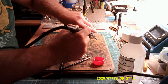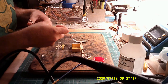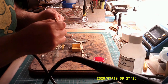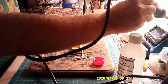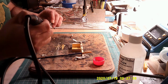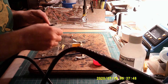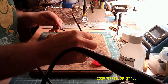I'm going to repeat that for all the rest of the parts. If you tin up all the parts to start with, it does save you a little bit of time, because when it comes to the second part of the soldering all you've got to do is sweat them on.